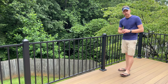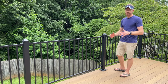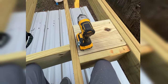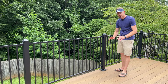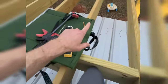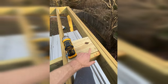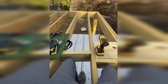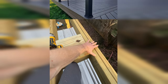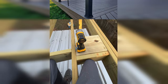Let's talk about the installation process. According to Fortress, with the instructions that come when you purchase, you are going to build some supports before you get your decking on. You're going to take a 2x8 or 2x10 — the same thing you use for your joists — and block them in horizontally. Then you're going to put a vertical piece and block that in as well. When you're done, you're left with a very solid surface to drill your holes and put your bolts through.